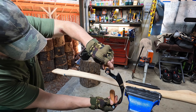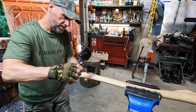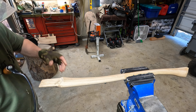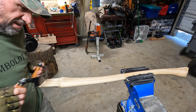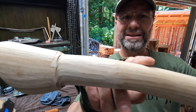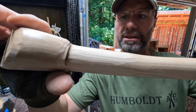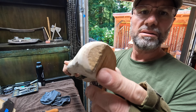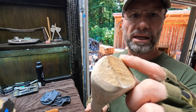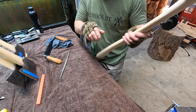I mean, I want to sand it good and put a burn on it. I try to take care of my handles as I'm working with them. I've seen so many ways of doing axes — I don't know what's right or wrong, I just know this is how I do it. I'm going to finish these up, put the grip on there, and bring it back. I just use a little belt sander and I make a pronounced swell there, taking it down a little bit. I also like to round off these edges — round the whole thing off. Plus, when you go to set that head, I've cracked handles not chamfering it off, so I'll chamfer it and smooth it out.